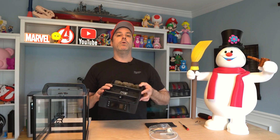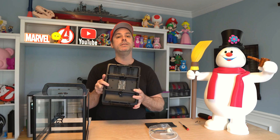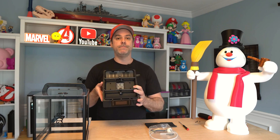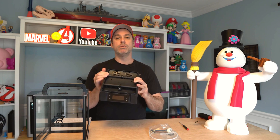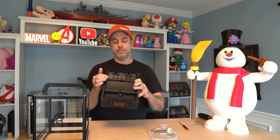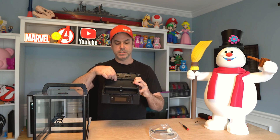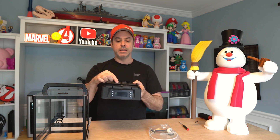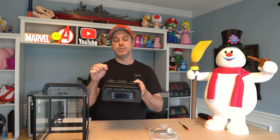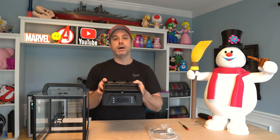Our enclosure is assembled. Moving on to the specs of the base. In the center of the base, we have a PTC heater and a single fan that blows that air. They have a plate that sits over that heater and routes the air up under where the rollers are to the filament. These rollers have a rubber coating on them. They are secured in place — actually screwed in, which is nice compared to some that just kind of pop in place. On the front of the unit is the humidity and temperature sensor, and on the back are rollers driven by that DC motor.